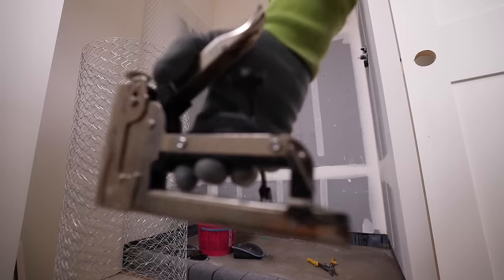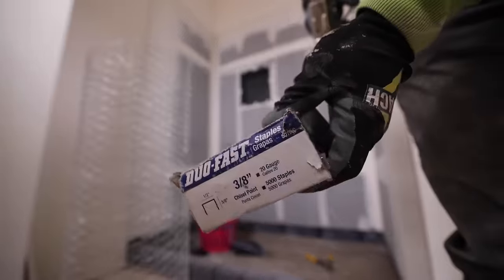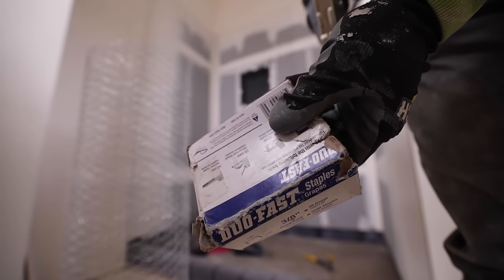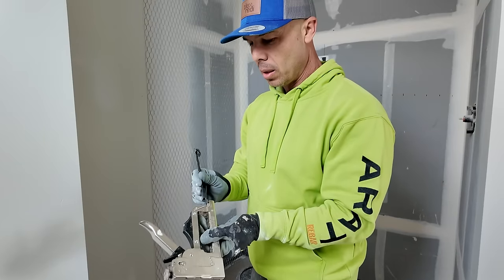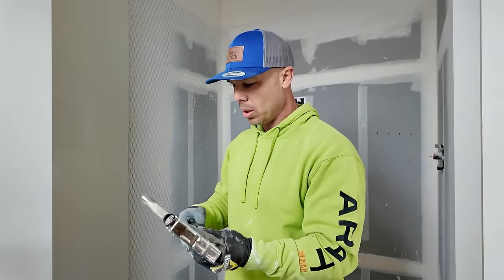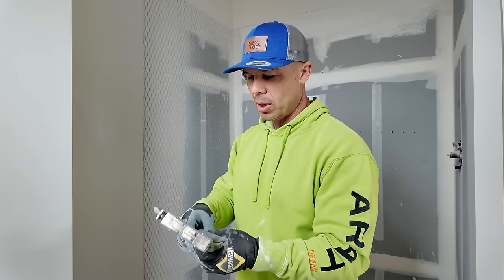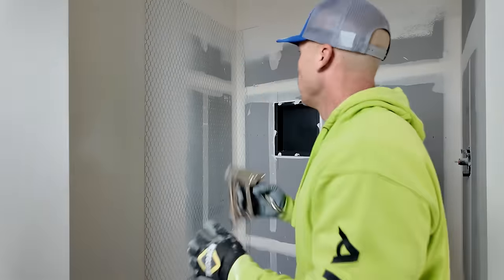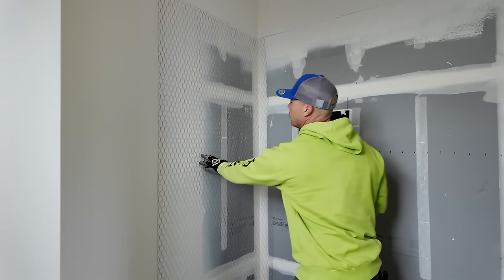More staples. This is a Duo Fast stapler, model CS5000, really good staple guns. These are 3/8 galvanized staples, so they won't rust. And these staple guns are awesome. Don't buy a cheapie. Check out the Duo Fast, not sponsored by them, never have been, just always have used these. Really good staple guns for putting up lath and stucco netting.